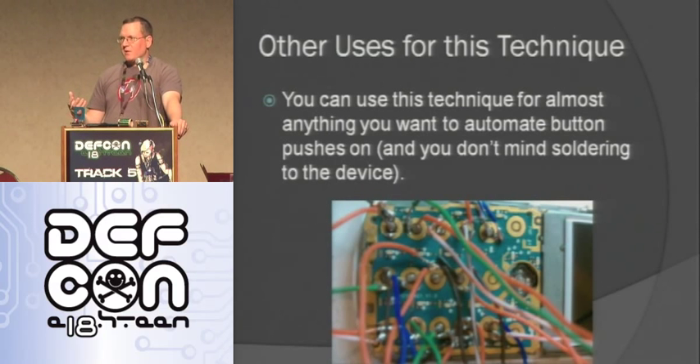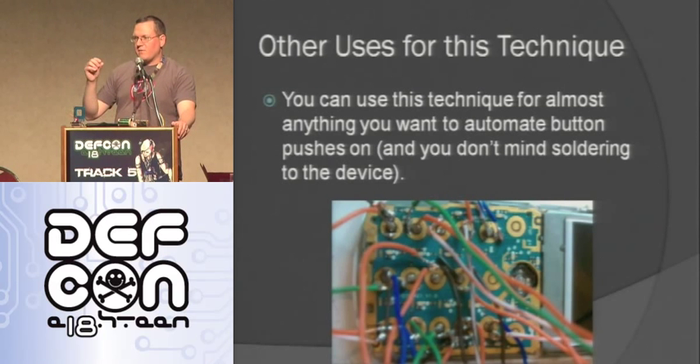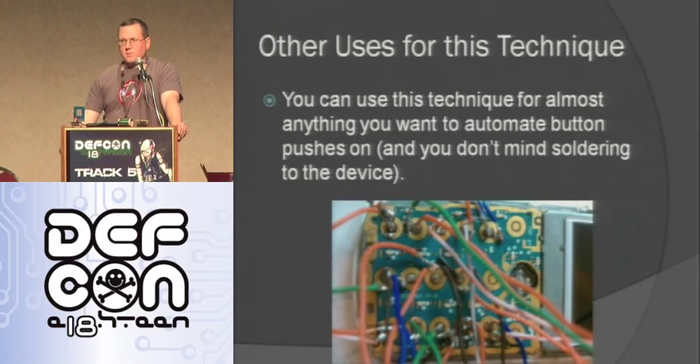You can do this with like a game controller. Here's a close-up picture of the cell phone. It may be hard to get this through airport security — just this phone with all these wires coming off every button. You can use this for pretty much any electrical device — open it up and it will either have these jaggy things, and when you push the button it just connects the two bridges. Or it has something like an outer circle and inner circle. You just solder to them, put a transistor on them, and you can run the device.